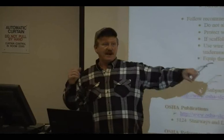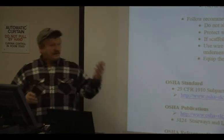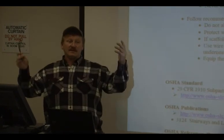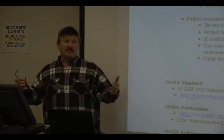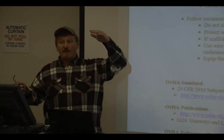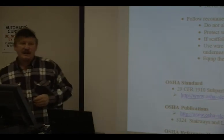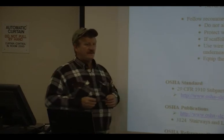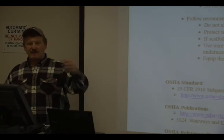In that same handout, there's a story about a guy carrying a 20-foot length of chain-link fence — he kind of sticks it up in the air while walking and gets hit because he goes into power lines. Same thing can happen on scaffolding. You stand up into an unprotected 220-volt power line going into your house, or at a place of business it might be 4,160-volt lines. Standing on aluminum scaffolding, you become part of the circuit.